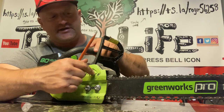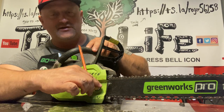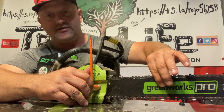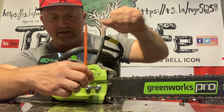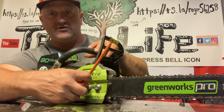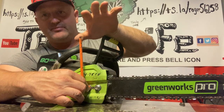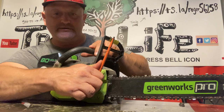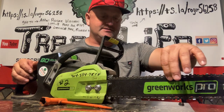If the side cover doesn't come off, always make sure you've got that chain brake loose and check it a few times — it's very expensive to get fixed and sometimes it'll ruin the saw. When tightening the nuts, only use the bottom of the wrench. Don't use a lot of leverage up top — if you crank down on it you'll get them too tight and the next time you go to loosen them you might pull your studs out or strip the saw. Just snug it up from the bottom, going back and forth.